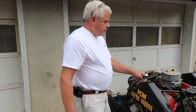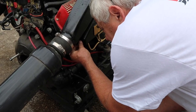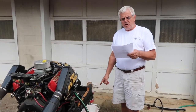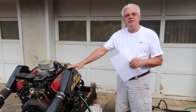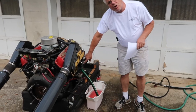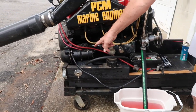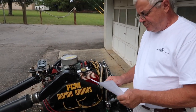Once all the fluids are drained out, go ahead and put the plugs back in. We've replaced all the drain plugs in the engine block and the exhaust manifolds. We've got some ethyl alcohol with glycol denaturants — it's an RV antifreeze. What I like to do is put it in a bucket and run a hose from our raw water intake down into the bucket. This hose usually goes back to the rear of the engine where the transmission cooler is, so you can take it off at the cooler and put it in the bucket from there.